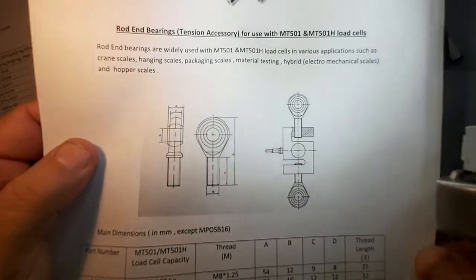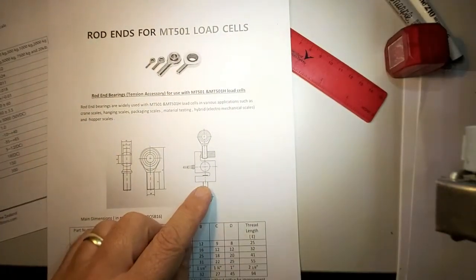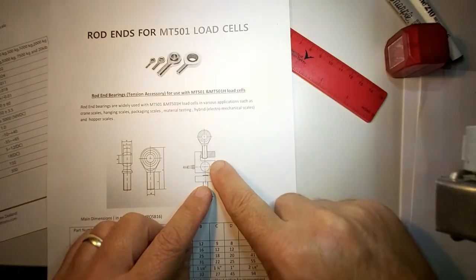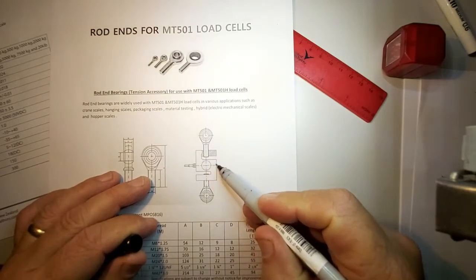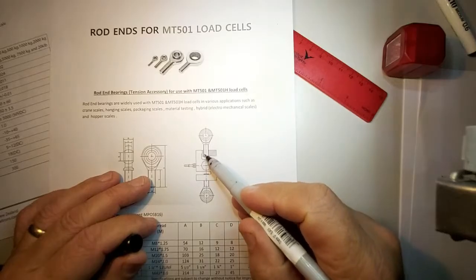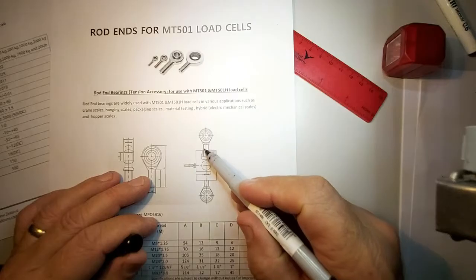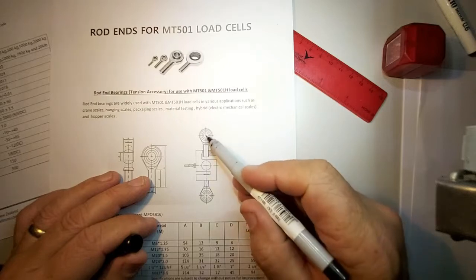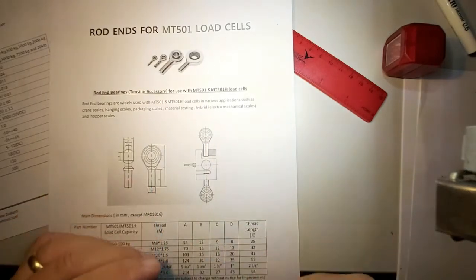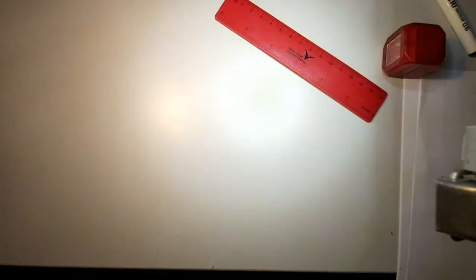This drawing is a bit interesting — what you're looking at has a cutaway section in it. This little section indicates a cutaway where you look inside and show the cut section using cross-hatching. That section is threaded, indicated by those double lines on the side. It's a bit hard to see, but all circles have center lines. It's a really useful drawing if you had to make that product.